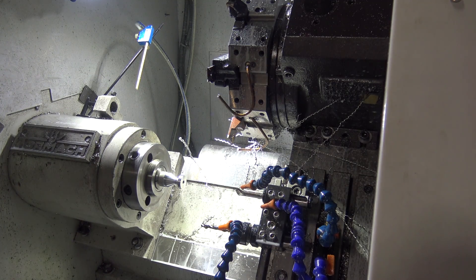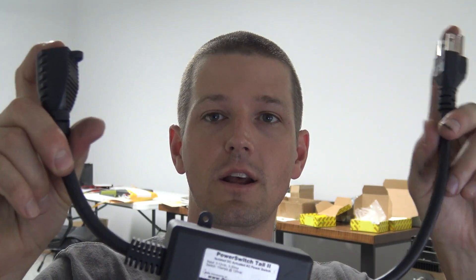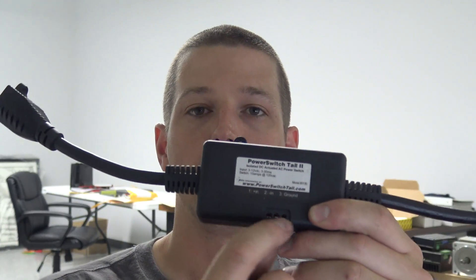Folks, that is huge — I love it, that is just awesome. I'm really glad the USB board worked fine because we're going to use that on the 440 project. It also occurred to me: we use a fog buster on our lathe sometimes and that has a 110 plug, which I don't really want to cut. So you can use something like this Power Tail — plug it in here, plug this into the wall, and then control the relay switches from the USB IO device. That way we're not cutting 110 power wires or damaging the fog buster. Links are in the video description. Take care — see you next Wednesday.